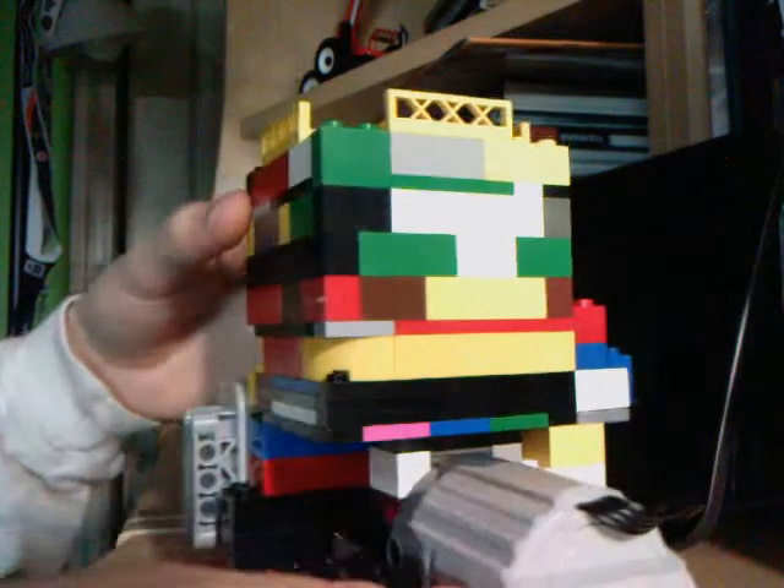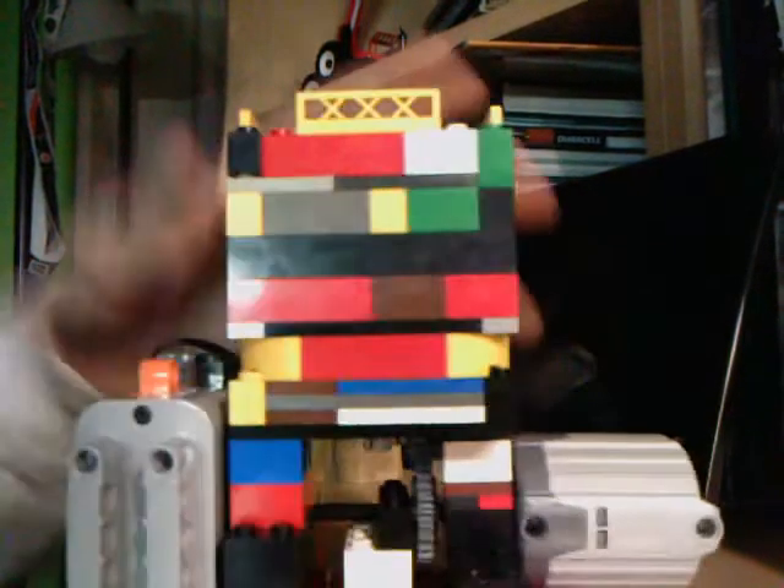360 view. In the inside is the hopper where the material is shredded — I'll show you that later. You might have noticed that the shredder runs on the vertical shaft, so what I had to do is use a series of gears to make it spin vertically, so the motor can be mounted horizontally like that.